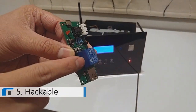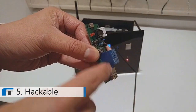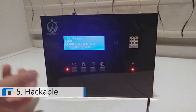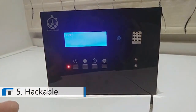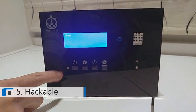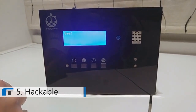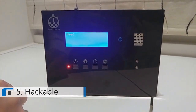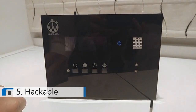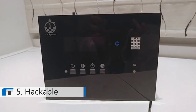For the final product, the relay will be a lot thinner so you can easily mount it. The Pi is now switched on. To switch off, just press the same button again. Now it's currently shutting down as indicated by the blinking LED. It's now monitoring and checking whether the Pi is fully switched off. And as you can hear, there's a click sound of the relay which cuts the power — and now the Pi is fully switched off.